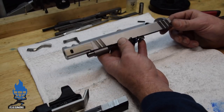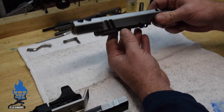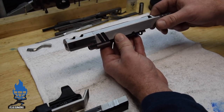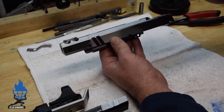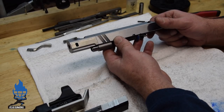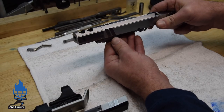We do stroke all open guns. When you stroke a limited gun, what tends to happen is the gun doesn't have enough forward thrust from the springs to come right back to zero — they return high. So we don't stroke single stack and limited guns, because it doesn't accomplish the goal of getting the gun to return to zero.